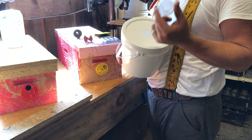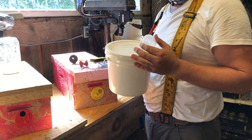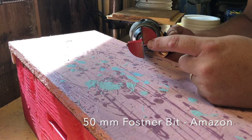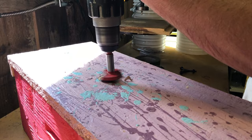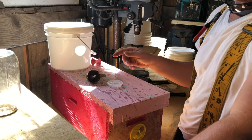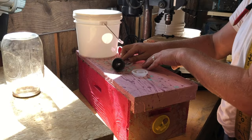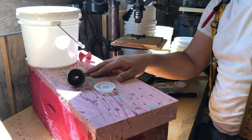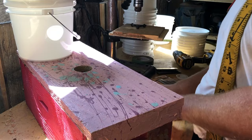These are tent plugs that you'd find on five gallon paint buckets. We'll have links for all the tools in the description. We use that 50 millimeter Forstner bit to drill a hole inside the lid. You can use the same tent plugs in that hole to close it off nice and tight — it doesn't leak. That closes off the hole for wintertime: no rain, no snow, nothing gets in. Then when it's time to feed in the spring, after you've come through the winter, you're good to go.